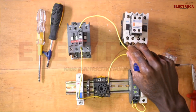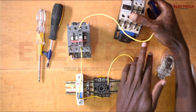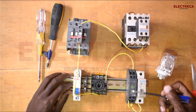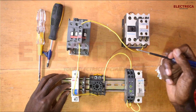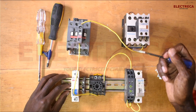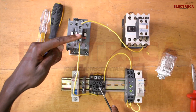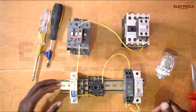This will go straight to the coil — A1 is right here — so this goes straight to A1. You can see that we would let our timer supply this contactor. This contactor is only 45 amps, which the current is small enough for the timer to handle, but because of the interlocks we've passed it through this relay, which will be controlled by the main contactor. If any of these fail, one will still hold the protection.